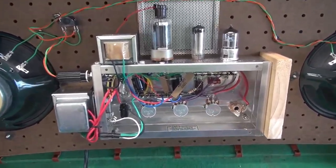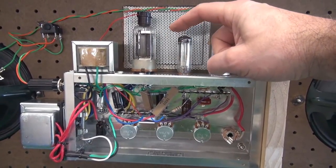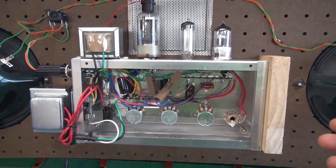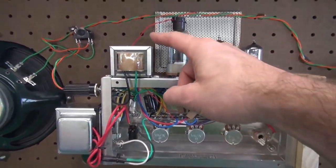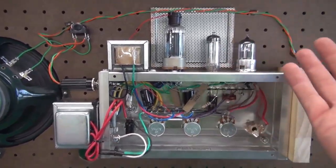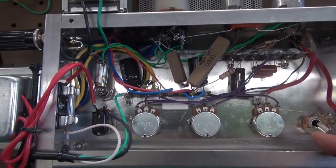Very cool. Here's the amplifier module, all right? Tube line up, 2E26 output tube. OA2 voltage regulator for the screens of that tube, and the 12AX7. Now, I've built several of these 2E26 amps. They're a little screamer, and this thing has a great Marshall brash sound, which is what the guy wanted, okay? Output transformer. This is your speaker plug, so if you need to work on it, you can just unplug the speaker assembly, take out the screws, and this module pops right off. Power transformer, controls, your fuse, input jack, and of course, the tube wiring.